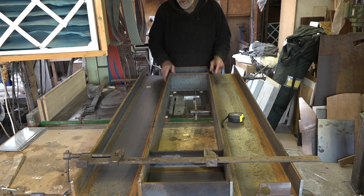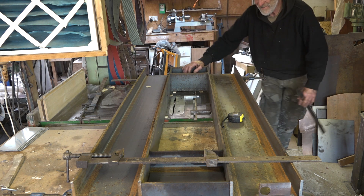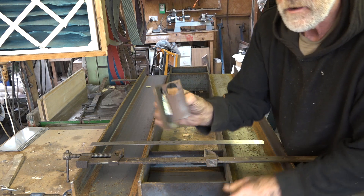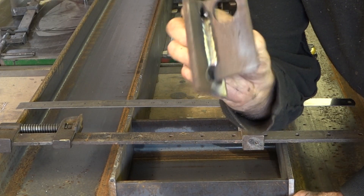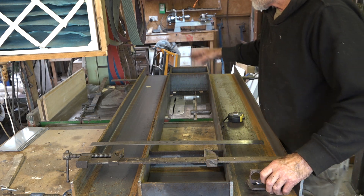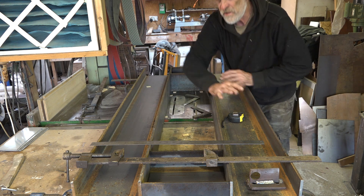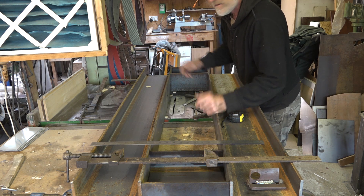That will give me a nice clean mating sliding surface for my squashiness thing. I've got my MIG welder but my MIG welder isn't big enough, so I'm going to use my arc welder on this. I've just done a little test and I'll be able to get a much nicer, bigger bead with the arc welder on fairly thick stuff — and it does that without any problem. So I'm just going to tack it together on here on this bench, weld up in this webbing a few good runs to hold it all together, then turn it around and square this end up and do the same there, then take it all outside and get it welded up.